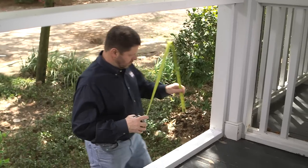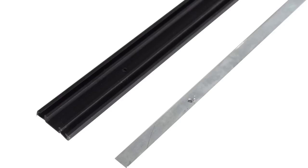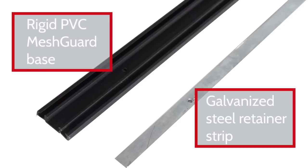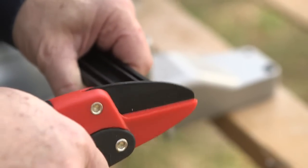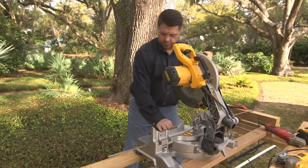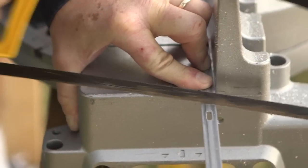To install your new MeshGuard, start by measuring the length of the channels you'll need for the sides. The MeshGuard framework comes in two sections: an outer base and an inner galvanized steel strip. The base is made out of a rigid PVC polymer and is easily shortened with a cutting tool. The galvanized steel helps to secure the base strip to the wood frame and can be cut with a jigsaw fitted with a metal cutting blade or by hand using a hacksaw.